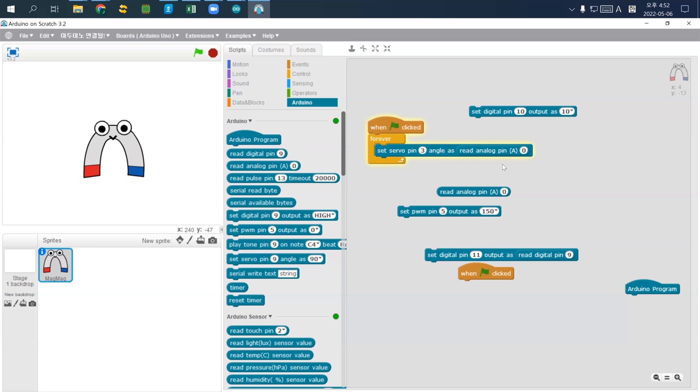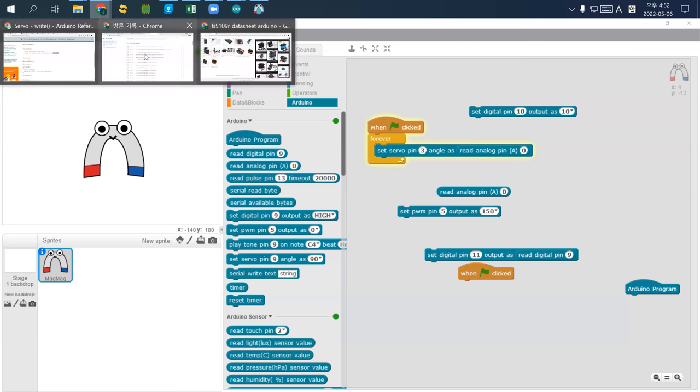Now it's kind of working in one direction. If I connect to 5 volt, and actually, if you connect it to 3.3, mine rotates very slowly. What that means is that I will check how A0 works. The option is you can connect A0 to either 0, 3.3 or 5 volts for now, and A0 simply reads the voltage it is connected to.